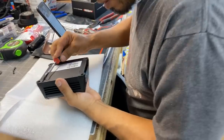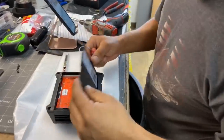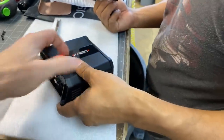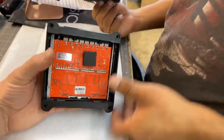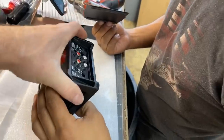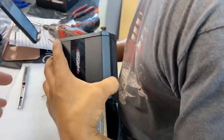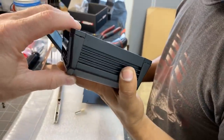What's the benefit of a small amp other than size? That's it — size. Oh, it's an upside-down design! I love when they do that. The amplifier is designed to be mounted this way, so the top surface is all for heat dissipation and the circuit board is on the bottom — all the heat rises. It's an extruded-style heatsink.